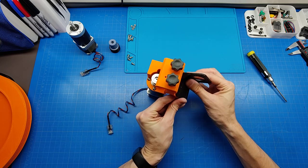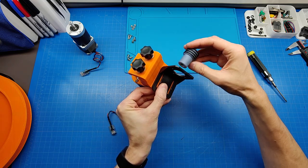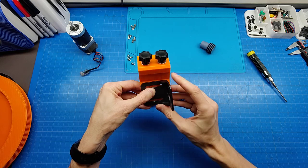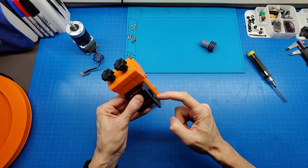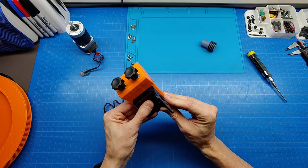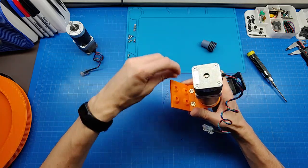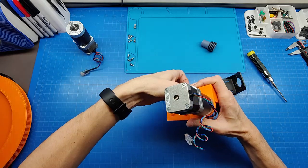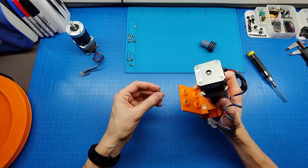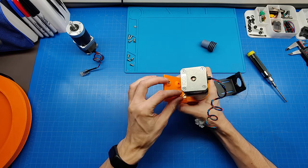Alright, putting this mechanism in place. Those cutouts over here will allow me to adjust the positioning of this friction drive against the edge of the bottom base of the Dobsonian mount, right? I already sort of know where it should be, slightly above, because there will be protruding bolts holding the motor, but somewhere over here should be fine. First things first, place all the mounting nuts inside their respective locations. Nice and tidy. And again, I will put a link in the description to the Thingiverse page where you will be able to download all those parts.